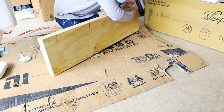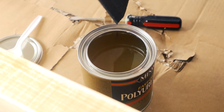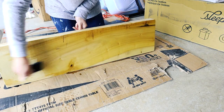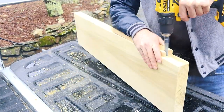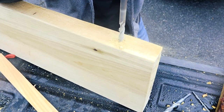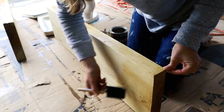My wife came up today and is helping clear coat these. We'll apply one coat, lightly sand, then apply a second coat, and maybe a third if needed. While she's doing the clear coat, I'll work on the holes for the second shelf. The products I'm using for this project are down in the description. This polyurethane is by Minwax and has a satin finish — we don't want too much shine on these natural-looking boards.